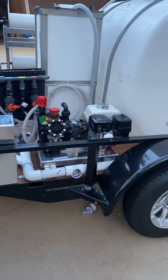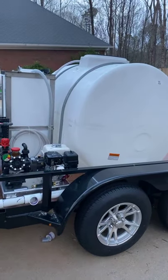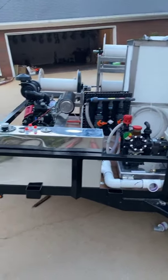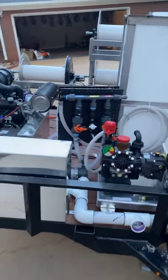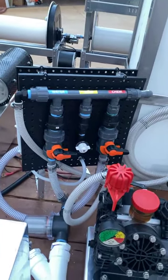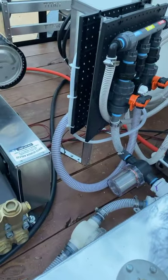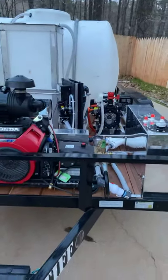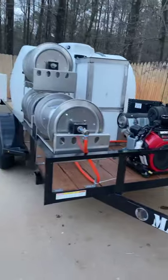This is the little rig I keep telling you guys you can do anything you want with. He's got the 500-gallon tank, the 55-gallon vertical tank for his bleach, the 17-gallon aluminum gas tank, and the manifold system that controls his water, soap, and chemical — built today and mounted on a stainless steel stand. The legs are stainless steel, the braces are stainless steel, every screw on this trailer is stainless steel. Everything is either stainless steel or aluminum so you don't have to worry about rust.